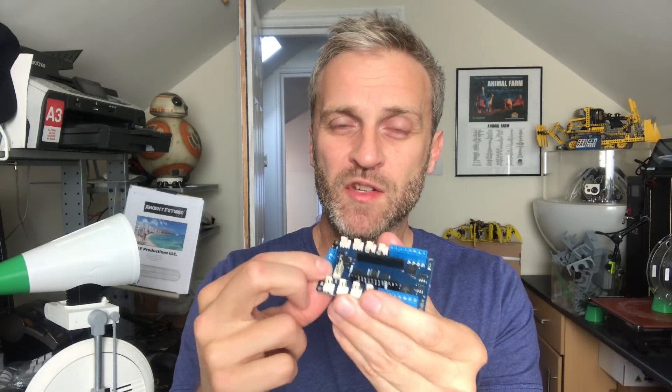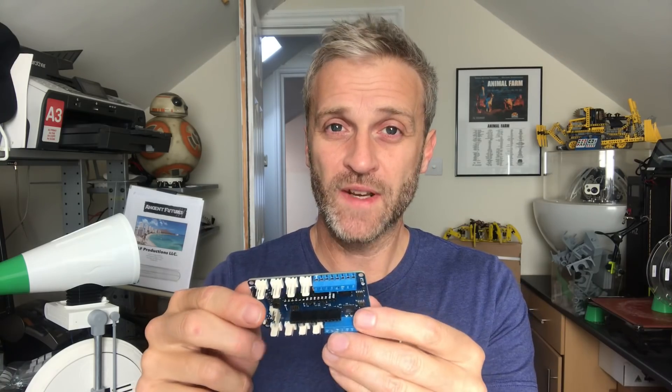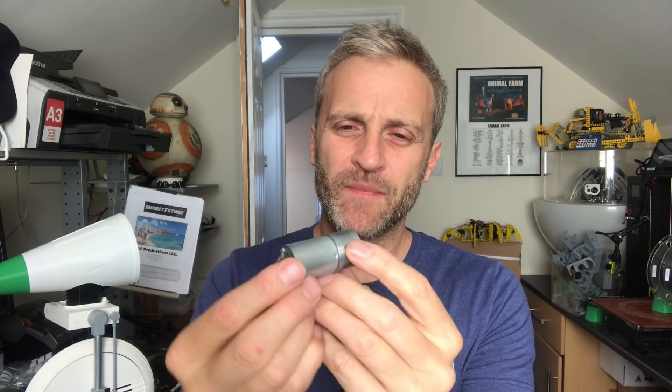Basically it means that the power switch on the board doesn't work anymore, but the power just goes straight through and it's not going to burst into flames. I've got the closed-loop feedback motors in and that made a huge difference — I've got some really lovely drivable motion out of Dio. But these motors have a certain amount of breakout force: in open loop mode the minimum RPM is about 60, and in closed loop mode I can get them down to about 30 RPM. I think I need to be down at about 10 RPM.